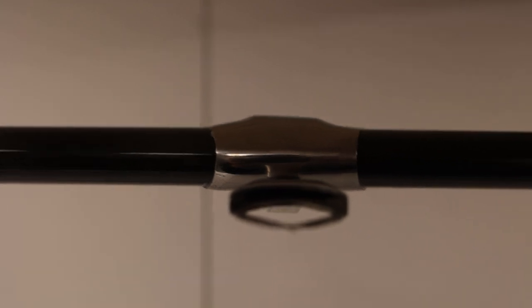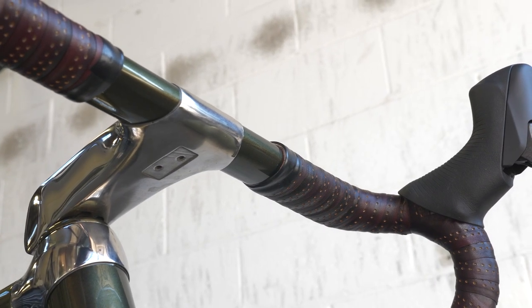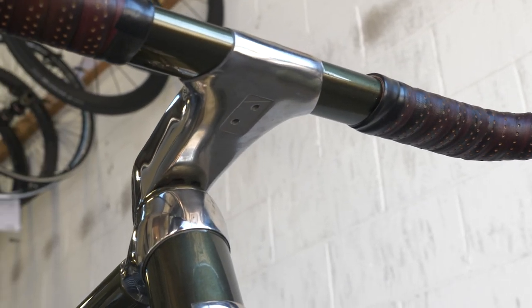What's the handlebar assembly — is it one piece, or a titanium stem bonded to a carbon handlebar? The crossbar is carbon. It embodies our ethos: carbon fibre is excellent at straight lines and simple shapes, so that's where we use it. The stem is titanium, which lets us tune stem length and angle easily. The drops are titanium as well. The join is past the shift lever, so the shift lever is clamping over a titanium portion — given some recent failures, I feel quite good about that. It also lets us put a lot of the cable routing detail into the titanium complex part. Getting carbon to go around the drop is no easy feat, so we've kept the carbon fibre portion as simple as possible in shape, and used titanium where it makes sense for detail or customisation.